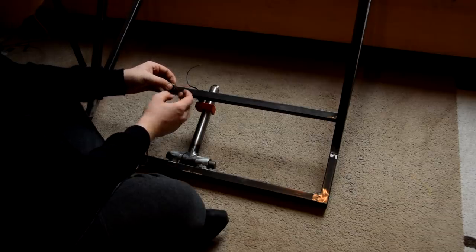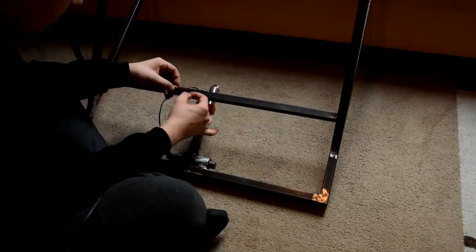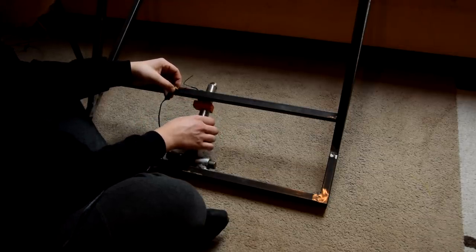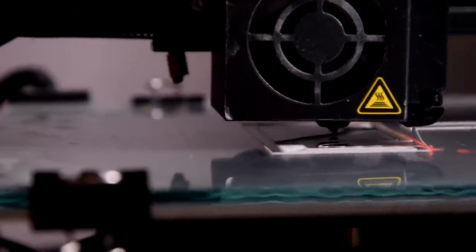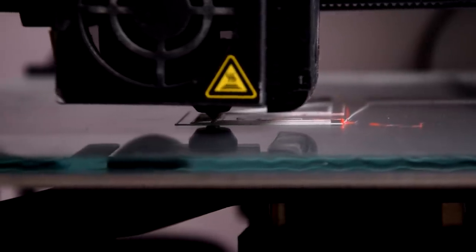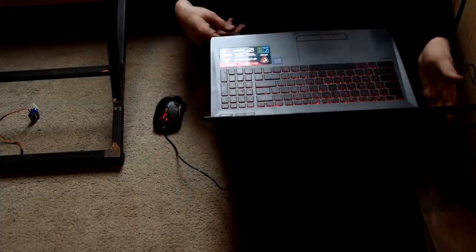Another problem was that the electromagnetic lock didn't have the strength to move after applying voltage. The load was too heavy for it. The first thing that came to my mind was a hook printed on a 3D printer, which will be gently lifted up by a servo. I printed it, subjected it to considerable loads, and I must admit that it passed the exam, but I know from experience that after a long time, it would deform and wouldn't be usable.